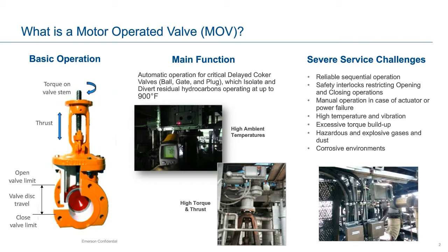Similarly, a motor operator can be assembled to an auxiliary worm gearbox, which will provide quarter-turn operation on ball, butterfly, or plug type valves. A basic control system for a motor operator will include limit switches, which set the open and closed stroke limits on the valve, along with torque switches, which limit the amount of torque output from the actuator to protect the valve. Integral starter, transformer, and remote control inputs are also typical in an MOV. Beyond that, there is a long list of options that can be custom configured for the particular application.